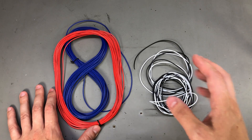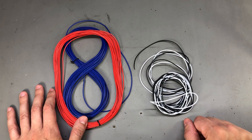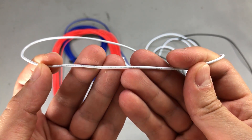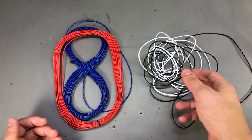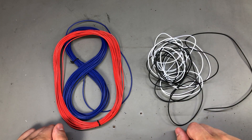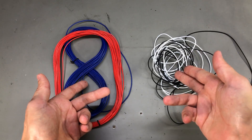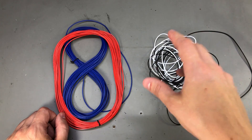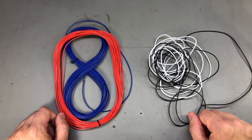The first item is a few different colors of AWG22 PVC cable. It feels decent, it has ratings on the insulation — 80 degrees Celsius and 300 volts. The reality is you don't need to use silicone wires for every wiring job. Sometimes if you don't need the flexibility or the higher temp rating of silicone wires, you can just use PVC type wiring. They are fairly inexpensive, so well worth keeping a couple of meters in different colors in the lab.